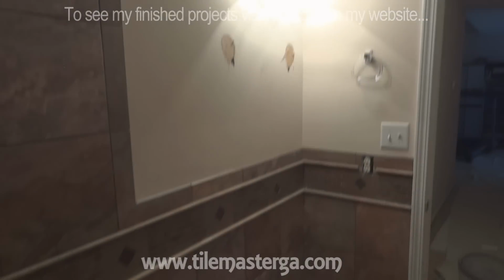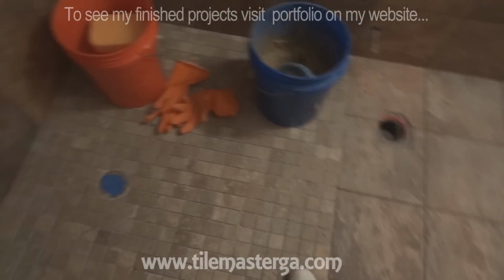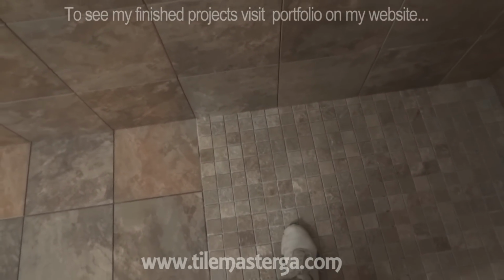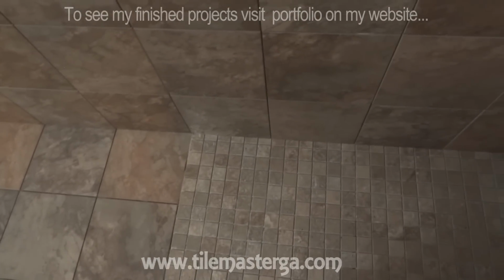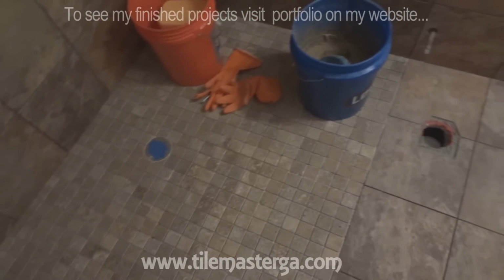So this is how it looks right now. Once again, a curbless shower here in progress. As you can see, no curb. One tip to give you, and it's good for every type of shower job, is to lay the shower floor first before you lay the walls. This is how I did it on this project, and this is how I always do it. This way water will not get behind the tiles, or if there is some, it will be very little, so there will be no problems with mold, etc.